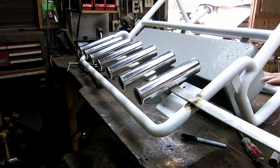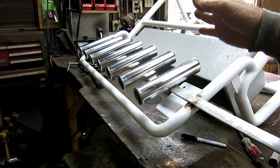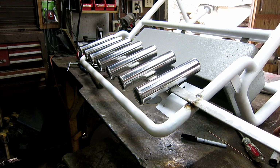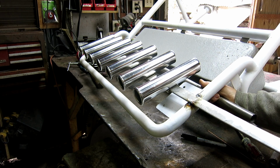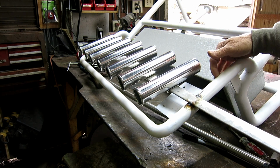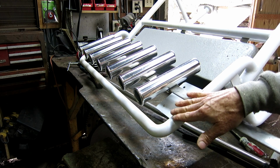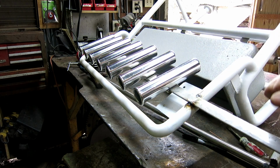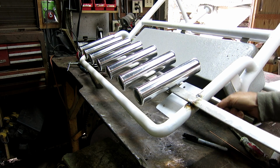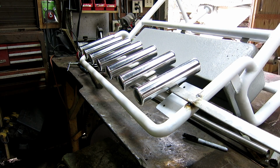So step 2, I've got the flat bar welded to the seat back, and it's pretty rinky-dink so far, but at least it's got everything steady so I can think and work on it. I've got some stainless steel tubing, so I think I'm going to try to put one back here all the way across. Maybe I can get a little tack on each one of these and weld this tubing here, and I'd really like to put one on the outside of this. I may go back to the bathroom hardware and go on the outside, because people grab stuff, and if somebody's about to fall over and they grab something, it needs to be really strong. So I think this one on the bottom will help. The real strength is going to come if I go on the outside of this, and that's what I'm going to shoot for right now.